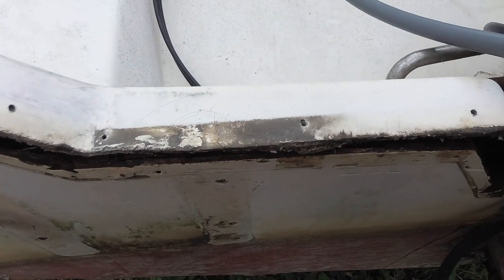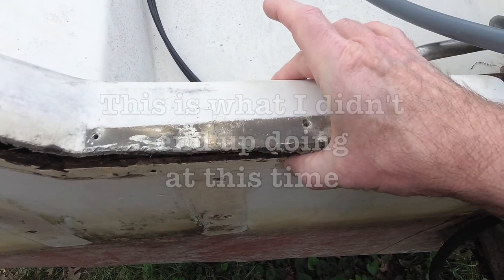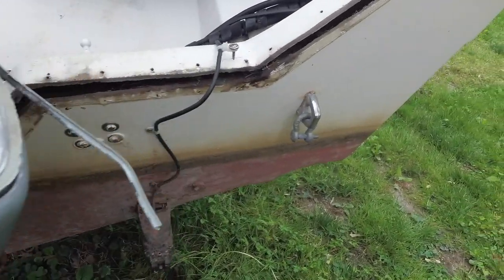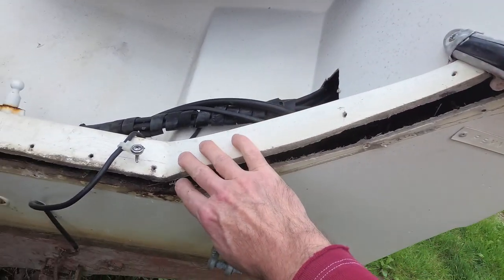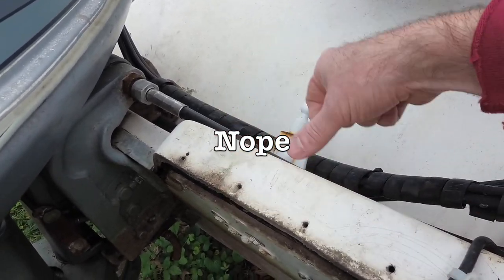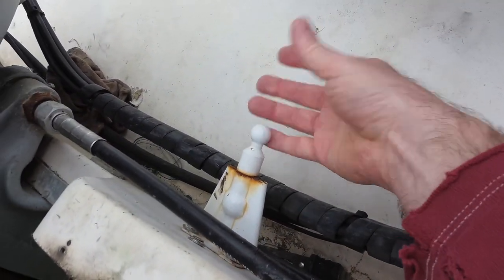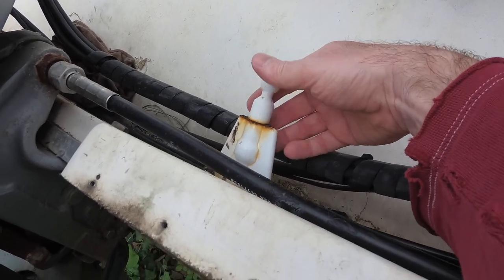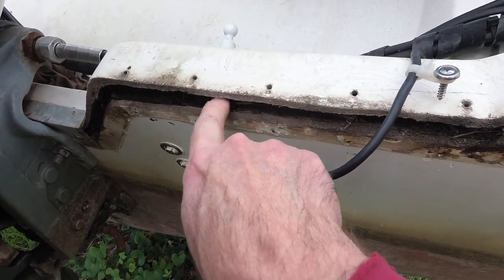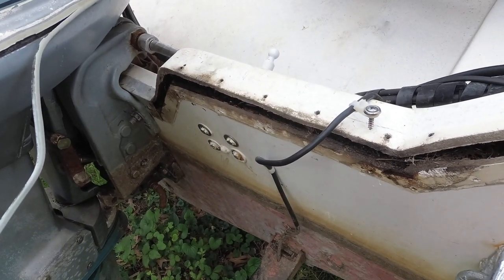My plan is to put a second bracket over top on this side, and then use smaller bolts to hold all of this together. This will help strengthen up the transom a little bit. I'm going to do the same thing on the other side — build the section that goes down here, piece that goes here, reinforce it with another bracket, and run two screws through. This side is more solid because of what I think is a flagpole or antenna mount, which is holding this part kind of solid even though the wood here is a bit sketchy. My thought is this just gets us through for another year or two, then we decide what we're going to do with the boat.